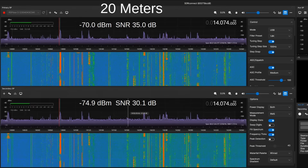Down here, what we have is on FT8. FT8 provides a nice cacophony all blended together for a 3 kHz upper sideband channel. We can see about a 5 dBm difference in received signal strength, and we also see less signal-to-noise ratio here than there. These numbers turn out to be fairly consistent.